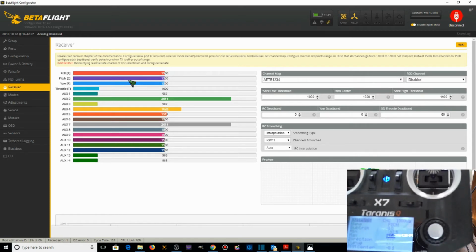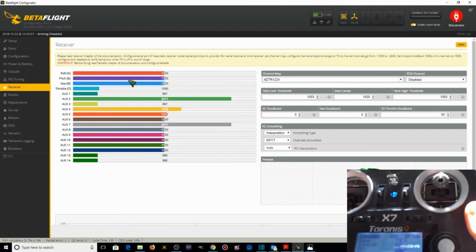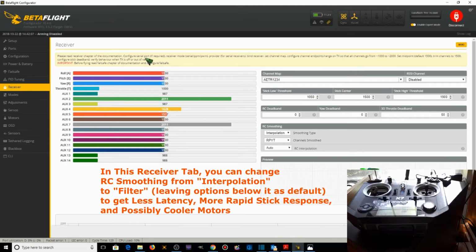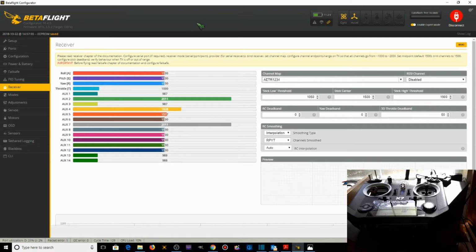Alright, so our roll and pitches have changed. Throttle's still good. Yaw's good. So based on that, all of our channels are mapped correctly with AETR. We don't need to change them to anything else. And the channel endpoints min, max, and center have been calibrated. So we're going to save this, and we're good to go to PID tuning.